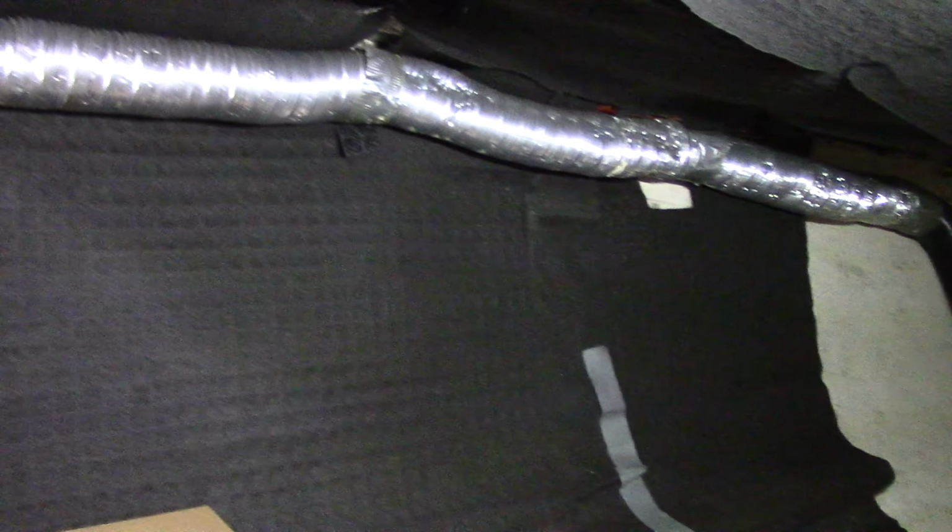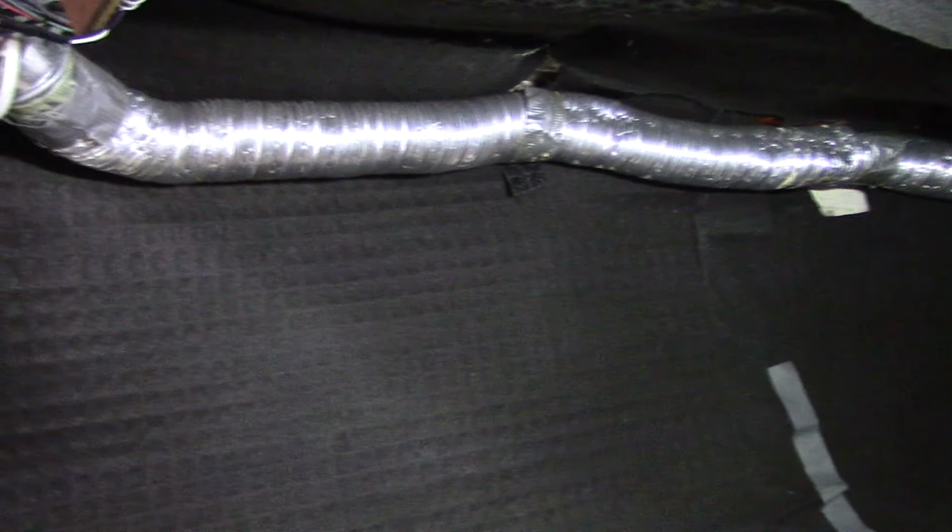And while we were living on the boat, condensation in the quarter berth, in the V berth, underneath for storage, got to be a problem. You know how things just get damp, either from the heat in the winter when you have the heat running, and then that condensation, or in the summer where you've got air conditioning running and it's hot outside. We did this product, Dri-Dek. I put that in the V berth first, and then in the quarter berth, which Sherry was using mainly for storage, the condensation in that was horrendous. I mean, we lined the whole quarter berth in that stuff, and it's worked out fantastic. Besides the engine hatch, this is probably one of the greatest things that I've put in.